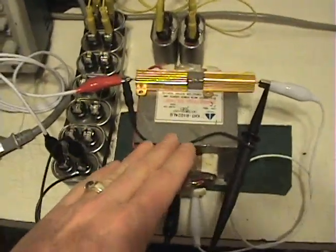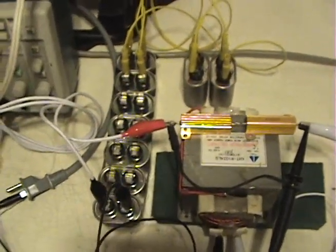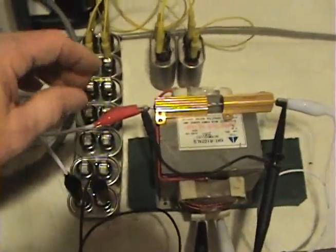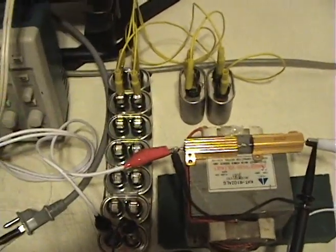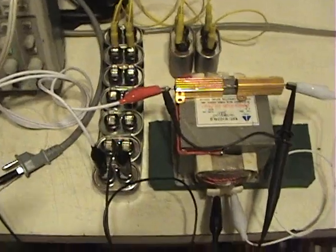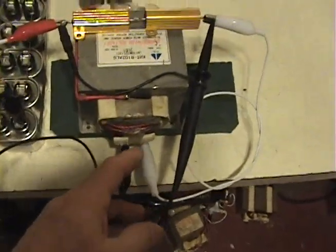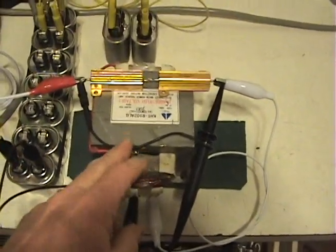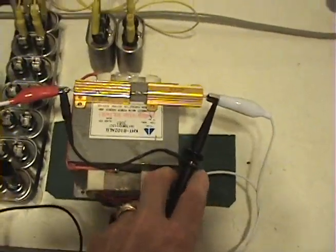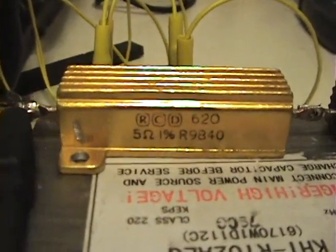Right now I have my circuit here and there's about 35, 36, 37 microfarad of capacitors. I've used all these little 5 microfarad capacitors because when you put a bunch of them in parallel you're really lowering the DC or internal resistance of the capacitors, so that's a benefit to make sure you're not wasting any power in the capacitor bank. These capacitors are still in series here, going across the primary, and the secondary is shorted. Out of the primary I'm coming to these two resistors which will be the load.